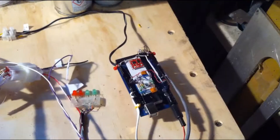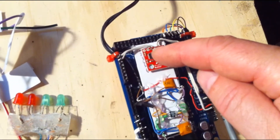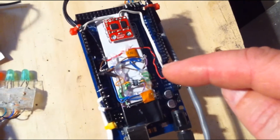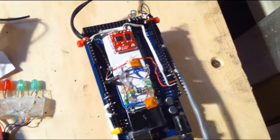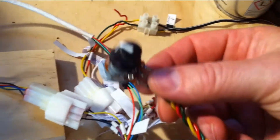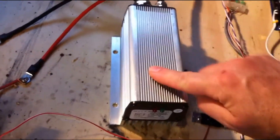What I've done now is connect my Arduino board with an IMU on it — accelerometer and gyro. There's a digital-to-analog converter, that tiny black dot, that converts the pulse width modulation pulses coming out to a steady voltage between 0 and 5 volts, which now goes into the setup instead of the analog reading from the potentiometer.